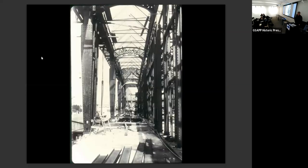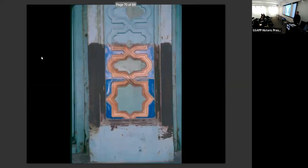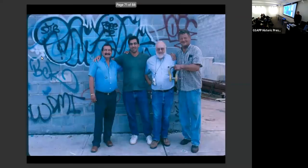Anyway, so I figured we knew exactly what this was and how it went together. But one day I was looking at some paint on the front loggia, and I said, Jesus, what the hell is that? So I had the guy remove some paint, and it turns out that these pilasters, or the frames that I showed you, were in fact cast iron, but they had a slot in them, and they had slipped glazed ceramic tile into the slot. And so we had to use a completely different paint removal method. We couldn't air-abrasively clean this, and that meant we had to use a different paint system for the outside of the cast iron, because we couldn't blast it without damaging the tile. So there's always something on every project that's going to challenge you and surprise you.